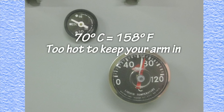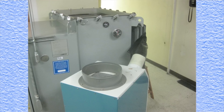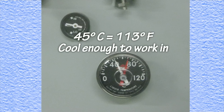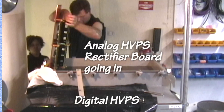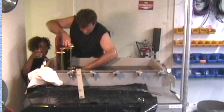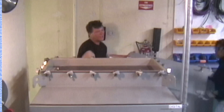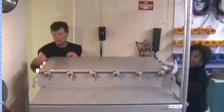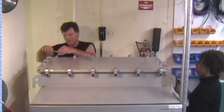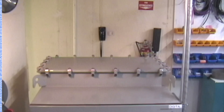Before the replacement rectifier board can be put into the digital high voltage power supply, it has to cool down. A portable air conditioning unit was used to cool down the oil in the power supply down to a comfortable 113 degrees. Here's the substitute rectifier board being placed inside the digital transmitter's high voltage power supply. It has to be mounted under the oil, and then all the wiring connections made to it. Here's the lid being placed back on and all the clamps being attached to keep a nice tight seal. Now the short across the high voltage capacitor needs to be removed, and the disconnect switch needs to be put into the on position, making the transmitter ready for its first test with the new rectifier board.